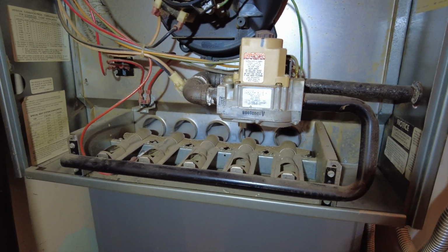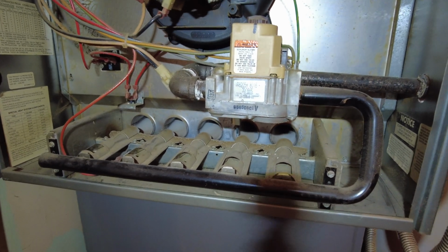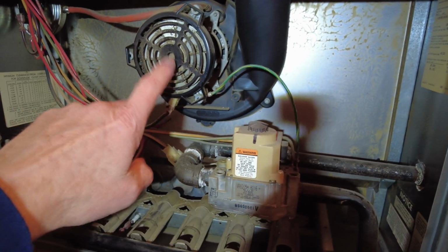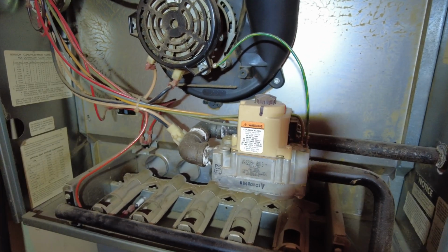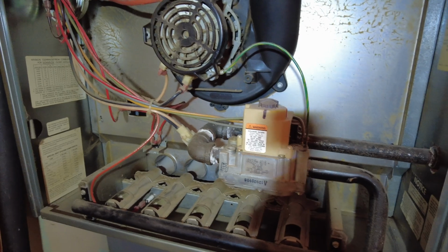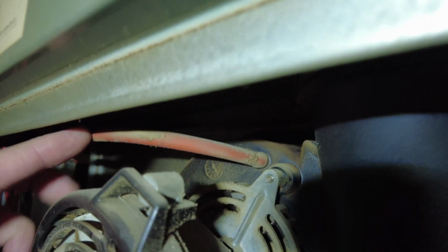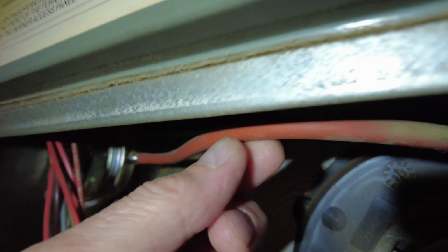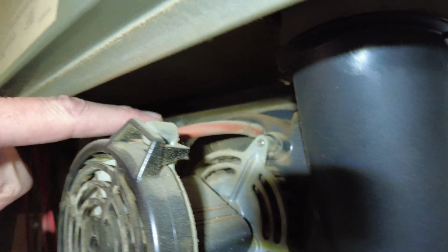Your furnace is going to go out on Saturday night at midnight when it's 10 degrees outside, which it is right now. Some basics. You got this purge motor right here, okay? This is going to blow the air box, blow the combustion chamber out, clear it of any gases before the furnace starts, okay? You got a vacuum. This thing here will pull a vacuum off there to tell if it's going to purge or make sure it's purged, okay? You can't have a broken hose here. You can also get a spider could build a nest in there and mess that up.